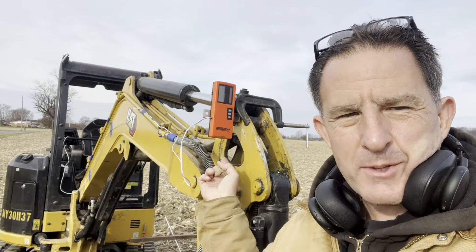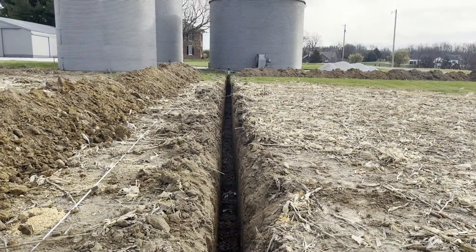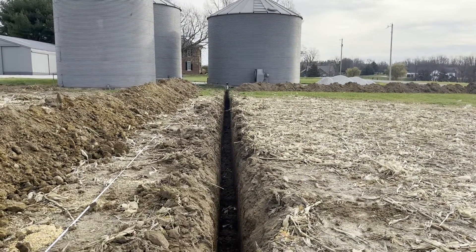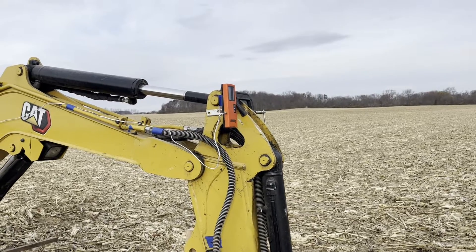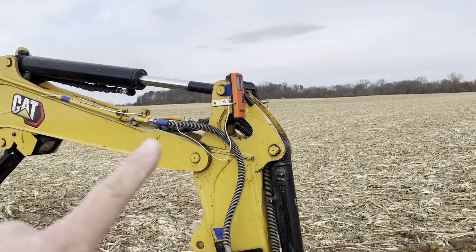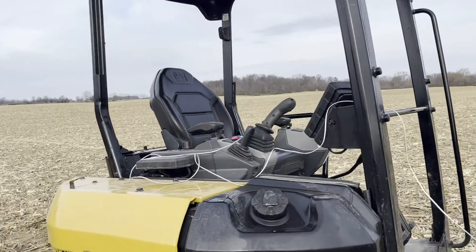Hi, I'm Lou, and today I'm going to show you how I put this laser sensor on my excavator. I'm digging this trench, and I've got a laser level down there to help me set the depth. This is only a $100 handheld unit that normally doesn't work here, but I bolted it on and pulled the speaker out and put it back here so I can hear it in the cab, and I'll show you how.